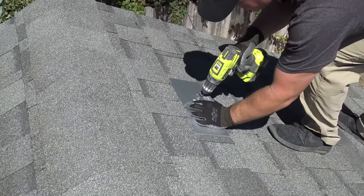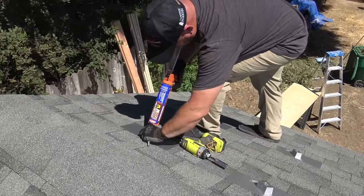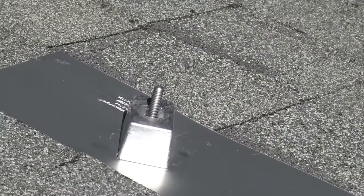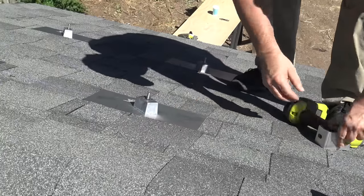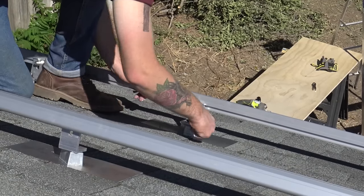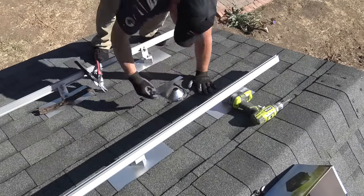The solar panels are going to be supported on rails. These rails will be connected to the roof at eight separate points. Each one of these points needs a piece of flashing to make sure that no leaks are created when we screw through the roof and into the rafters below. These mounting points are secured to the rafters with lag screws that have bolt threads on the other end. We squirted some sealant into the holes in the flashing before driving the lag screws in. We then bolted on some specialty L-brackets that will allow us to mount the rails. We need to drill a hole through the roof to run the wires from the solar panels to the charge controller. We located this hole under where one of the panels will be and then inserted the flashing.